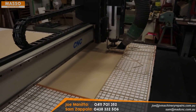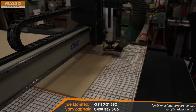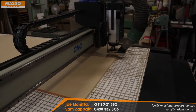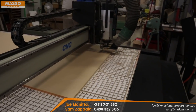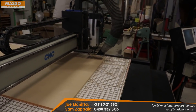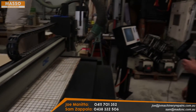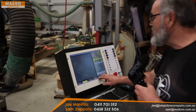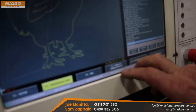Thank goodness that compressor turned off. That's another feature Maso added in for me — air pressure. With a tool change router you need air to release and clamp the chuck, so they put in an air pressure low input. If the air pressure isn't connected, I'll get an alarm on the screen — really handy feature. For anyone with a tool change router it's invaluable. Job finished — going by the little clock here, which I only just noticed a couple of days ago, it said two minutes and 31 seconds. Not bad, I'm quite happy with that.